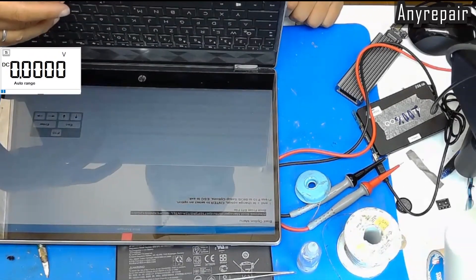And I think that's it — our problems are solved. That was the repair as you saw. It was a difficult one. A lot of us would go and refresh the BIOS, check the BIOS, or assume that the PCH is not doing well. But as you saw, it was only a pin and pad connection issue. If you liked this video, consider the like, subscribe and share. Thanks for watching. See you in another repair. Bye.